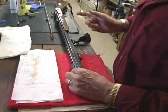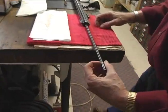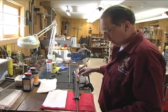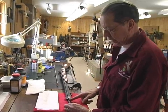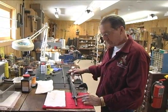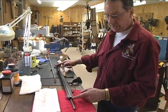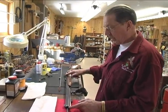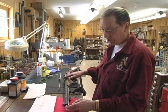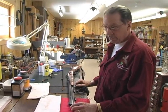Check on your ramrod with the gun empty so that you know if you have a load in there or not. If the rod goes all the way in to a certain point, there is no load in the firearm. When you have loaded the firearm, you would want another mark on your ramrod so that you know the distance — if loaded correctly and the ball is pushed all the way in — from the load to the muzzle, to ensure that bullet is seated properly. You do not want to pound on the ramrod to set your bullet or produce a compressed charge. Just seat it firmly on top of your powder charge, or on top of your pellets if you're using pre-measured pellets.